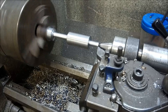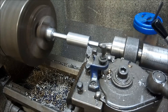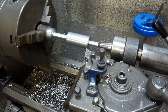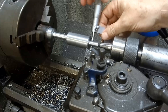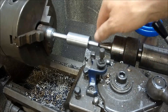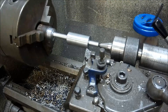We'll just machine that off to diameter now. I'm at about 0.02 over nominal size. I'll just use a bit of emery to bring that back to spec to suit the bore on the pivot. Whatever that comes back to, we'll make the other one the same. We'll get this down close anyway — we'll re-set the geometry on our tool and come back to start machining.